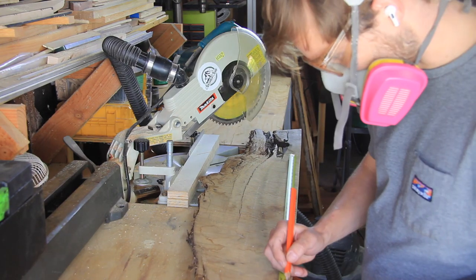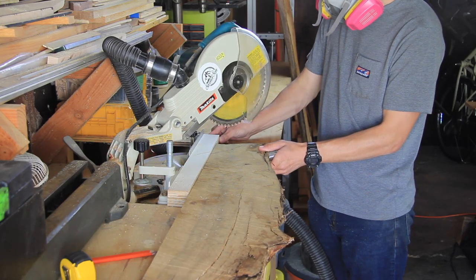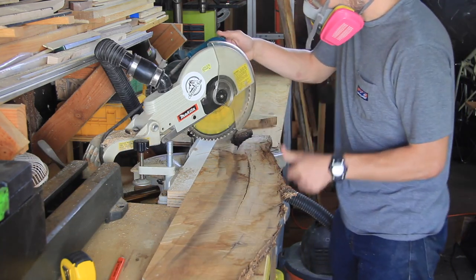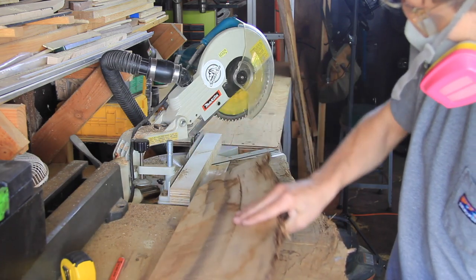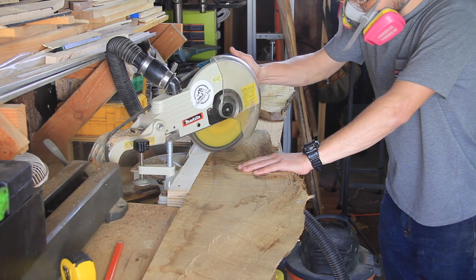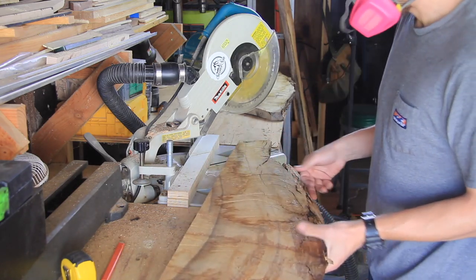I made my measurements on the straight edge of the piece of oak that will be the inside length of the frame, so the miters would extend outward to the ends of the piece of wood. Then I did the cut and it was a little scary — miters are scary — but if you make a mistake with miter cuts there's usually a way to fix them, which I actually ended up having to do for one or two of the miters later on. Once I had one piece cut, I used it to mark the second piece that would be the exact opposite piece in the frame — in this case the top and the bottom — to ensure they were exactly the same, even though the tile work itself was not completely square. I'll be hiding that with a recess, which I'll show in a later part of this series.